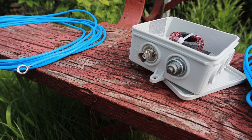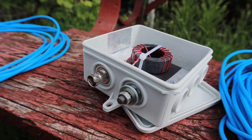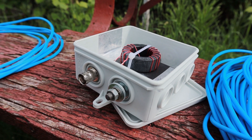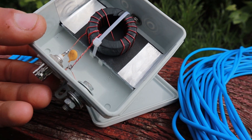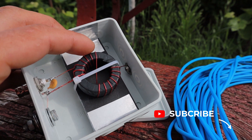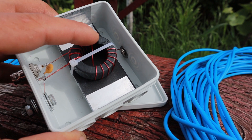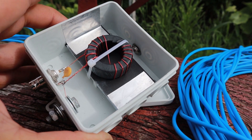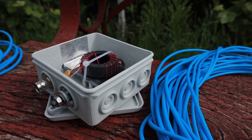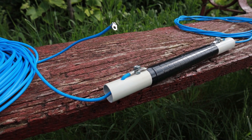From there it will connect to the transmitter or receiver, and probably I'll also use an antenna tuner at some point when I build one. Right now I'm going to use the older impedance transformer core to build an RF choke, since I don't have one. Probably next week I'll show you the video about how I made the RF choke — for now it will also work without one.